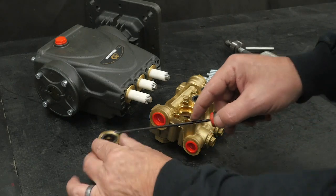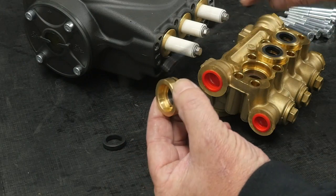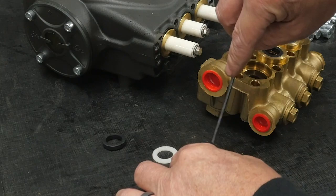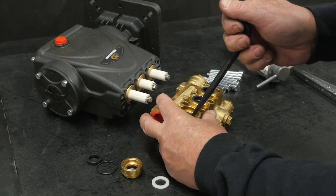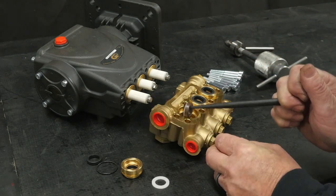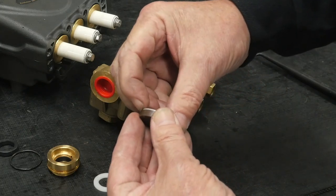Use a round head tool to remove the low pressure seal from the retainer. Also remove the O-ring from the retainer. Use the hook tool to carefully remove the high pressure seal and the high pressure head ring, then separate the high pressure head ring from the high pressure seal.